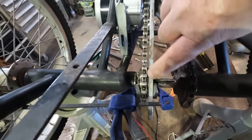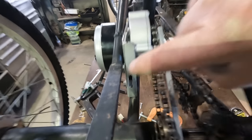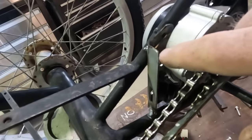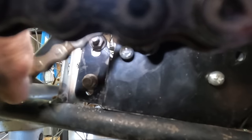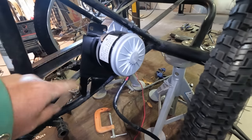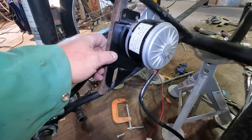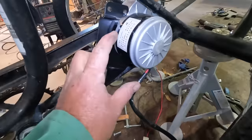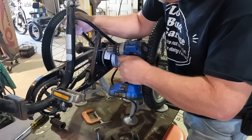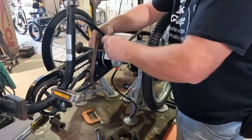I've got some key stock clamped to the sprocket as a straight edge so I can check my chain alignment. I've got one mount tacked into place. The bracket has oval holes where I can slide the entire motor plate upwards to adjust chain tension. I cut a piece of angle to go right here and I'm going to drill a couple holes in this plate — once I do the final welding and painting I'll slot them so the whole motor can slide up and down. Permanent magnet motors have chips stick to them — go figure. It's like it's a magnet or something. Chain should stay on now.